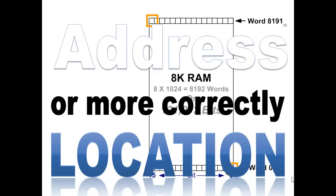As we go along, you will notice more use of the term memory location than memory address. Before there were street names and house numbers, the word address was strictly a verb, never a noun. When we get into programming, we use the instructions that address memory locations, much as you address a person with a question or a statement, a read or write. When you make a statement addressing an individual, you're setting their state. If you ask a question, you're reading or determining their state. This fine point will make it easier to follow the description of logic programming.